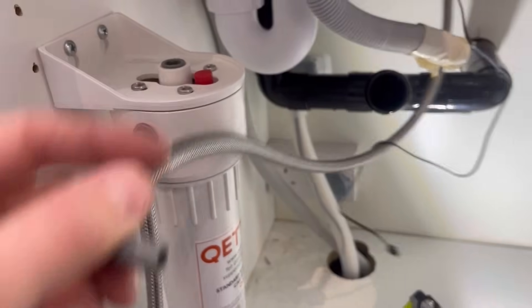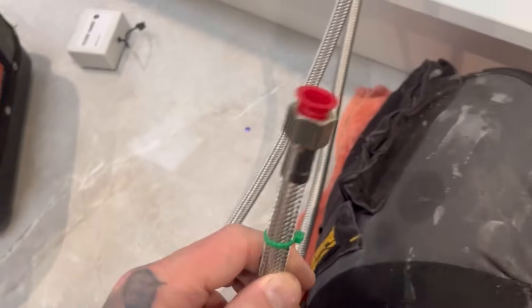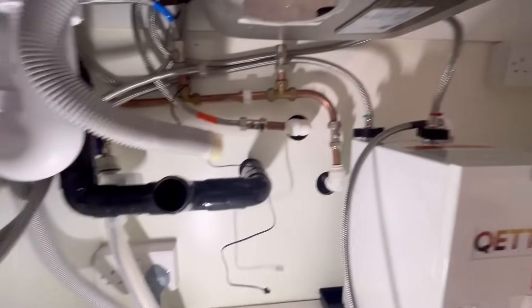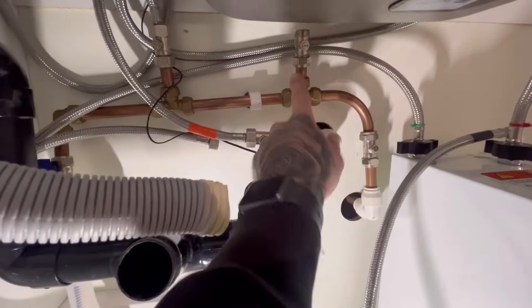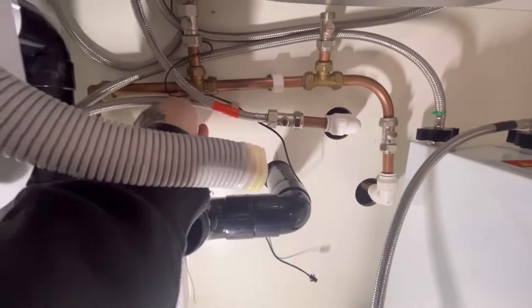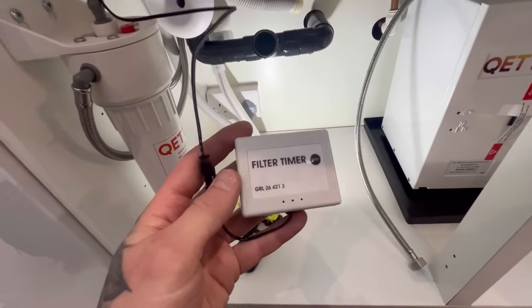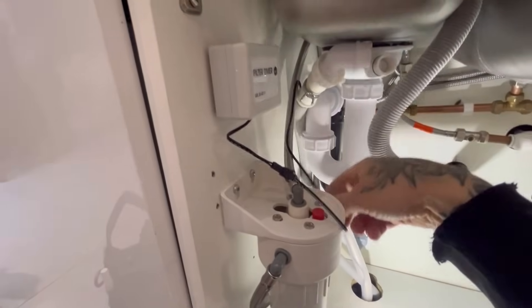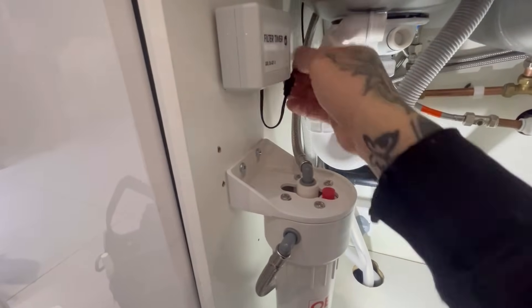That one is going to go in the top of there. Pushing in the top of there now, and the one with the green tie wrap on is going to go back to our tank - colour coordinated, there's a green sticker on there. They just look a mess, don't they. That is basically going into our waste outlet. This one here is connecting on to that full bore isolation valve. So I'm going to take this elbow across, into that - this little plug goes into this little filter timer. Stick it about there with the velcro tab. Street elbow straight into this isolation valve for the filter - done.